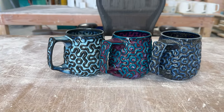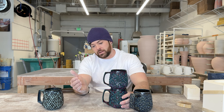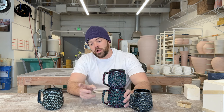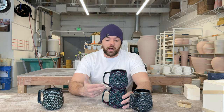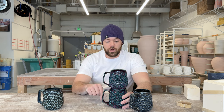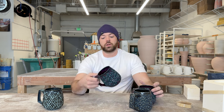My handles have also changed a lot this year. Here is one from last year — I'll get a close-up of this as well. I've completely redesigned my handles from the ground up. Not just adding the texture, but the handles themselves are a slightly different shape. I've dove into sub-D modeling in Rhino. It's something I've only done for one other project before, but it worked really well for handle modeling. I was able to change it on the fly, printed three prototypes, and landed on what I wanted. Changing the geometry with the way I modeled the previous version was really a pain, and using sub-D modeling in Rhino has been absolutely amazing.